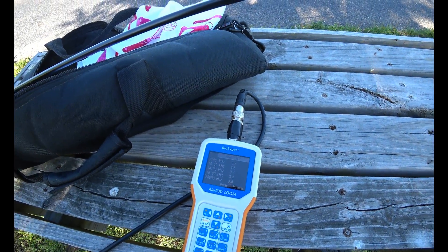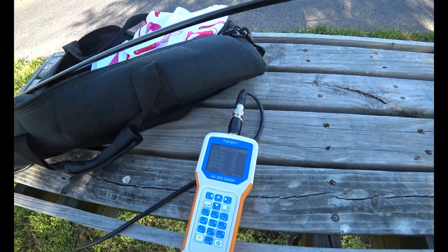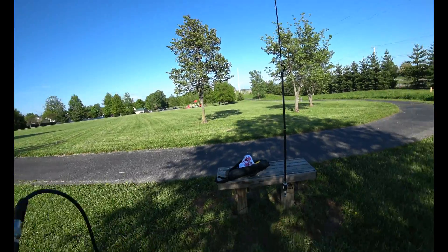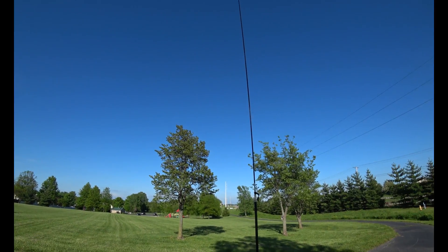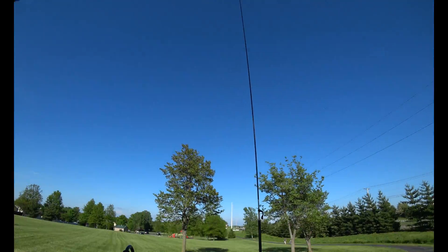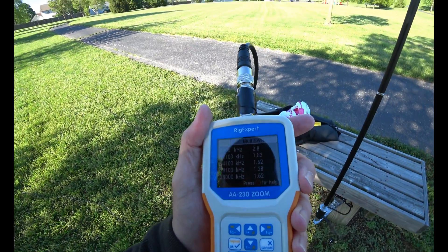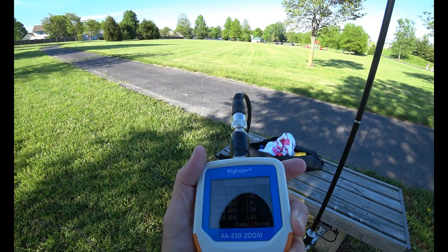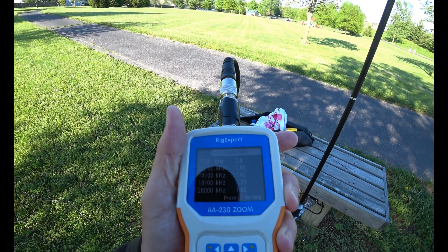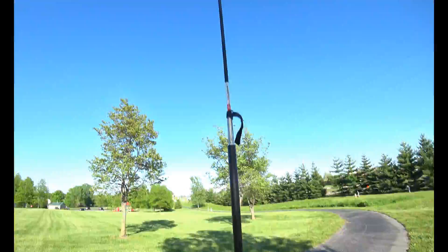That's my initial analysis. I remove it, put it back on - 1.05, I love that. For 40 meters, I would love to get this elevated and work a little bit, but I need a tower. Just for experimental entertainment reasons, I put two sections of my Buddy Pole and then the antenna mast - everything is compatible - just to see what would happen. I put the counterpoise on the bottom and my readings are 2.8 on 40 meters, and then everything else is below 2: 1.8, 1.6, 1.28, 1.62. That's with an extended mast, just to see what would happen.